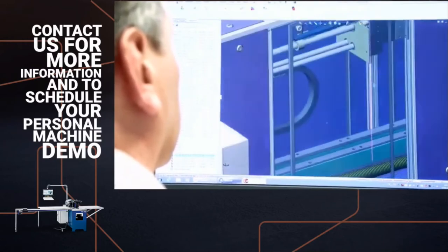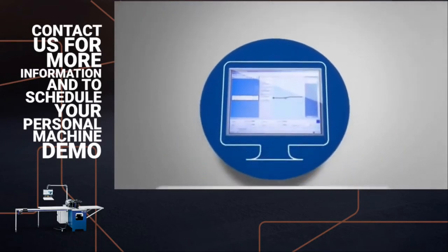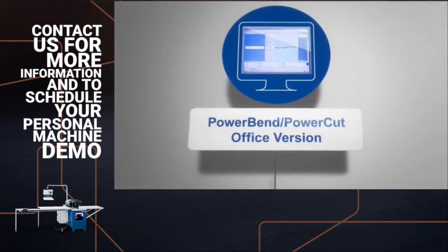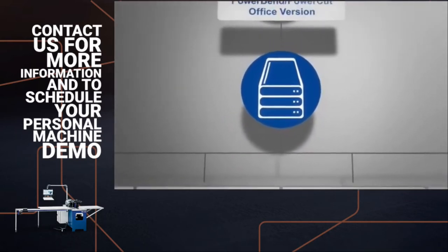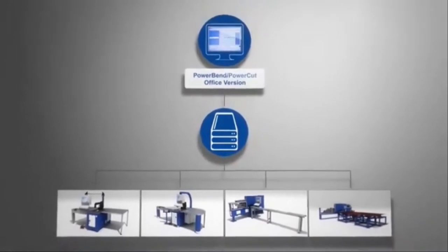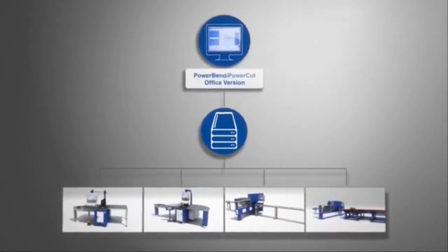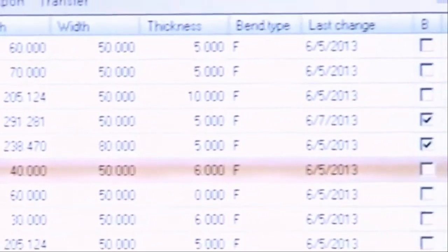The construction's CAD data are translated end-to-end into machine programs via DXF import. The machine software PowerBend is also available in an office version. All stages of the work process can therefore be set up with a regular computer. All programs are stored in the same database on any given server, which is linked to machines and office workstations. The advantage? The number of workpieces is unlimited. Bending machines have access to punching data and vice versa, with all workstations being up to speed. Thus, the number of workpieces stored in the program's database is practically unlimited and can be located easily with the help of search and sort options.